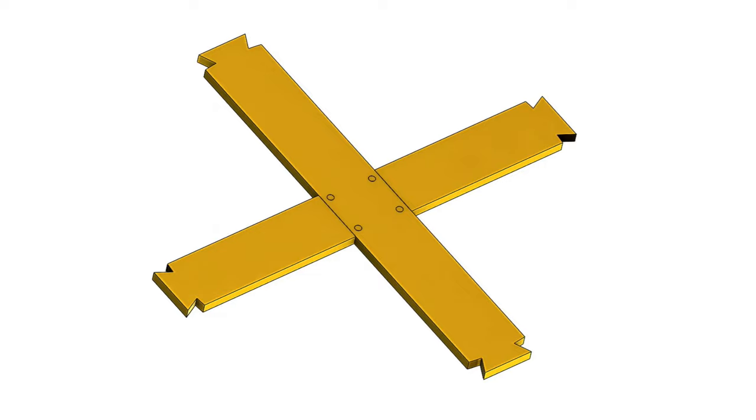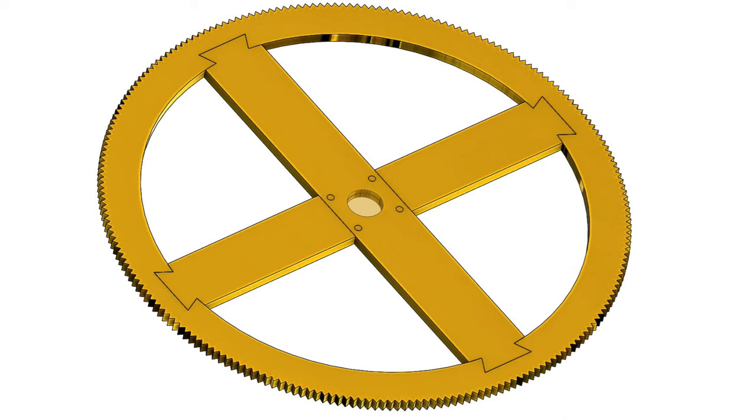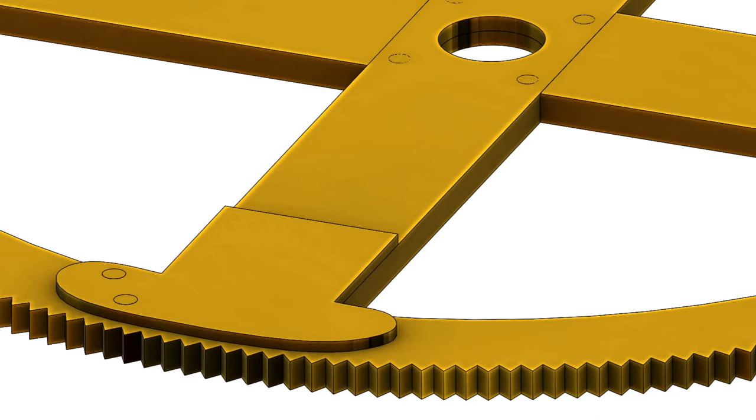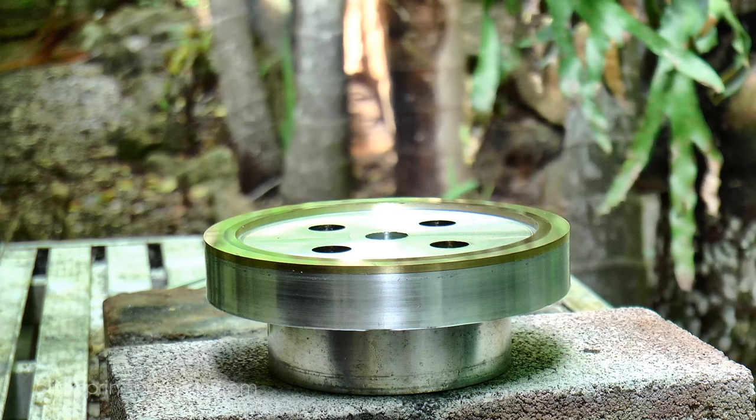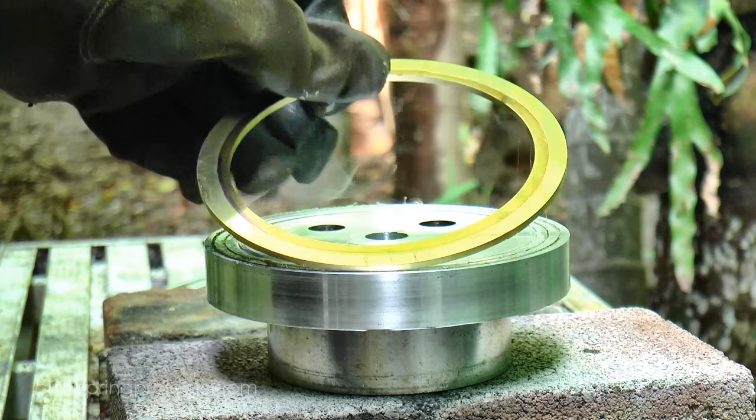As per the original device, the cross members will be notched, drilled, and then riveted together. The dovetail joins will be filed to shape for an interference fit with the perimeter ring. A central hole will be bored, and of course the teeth formed at the perimeter. Now the scans show what appears to be an amendment to one of the dovetail joins — a thin sheet of bronze has been both pinned and soldered over the top. It could be a feature of the planetarium support structure, but I think it's more likely to be either a repair, or a preemptive effort to strengthen an otherwise weak join. It will be interesting to see if there is an inherent flaw in the dovetail join that requires me to make a similar amendment later in the build.